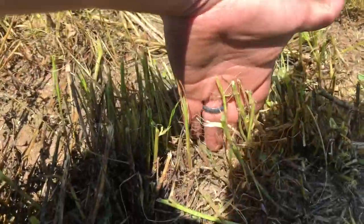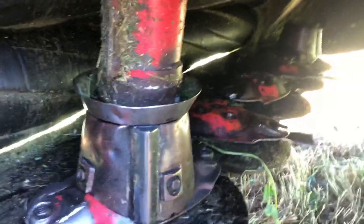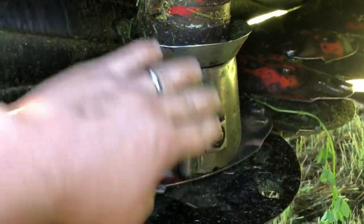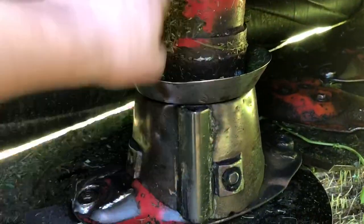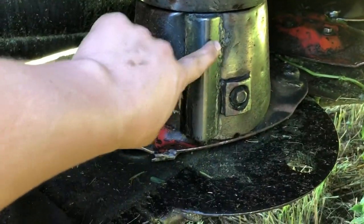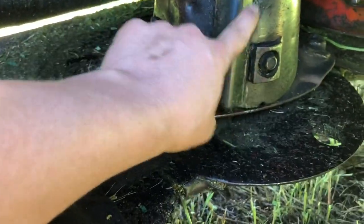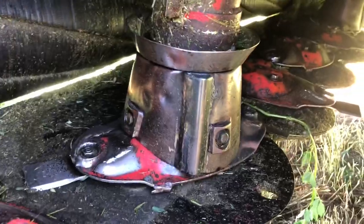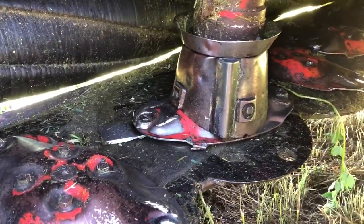I just want to show my stubble height after I lengthened it — it's probably about 4 inches, I would say. I wanted to check under here. We have no wrappage — if that's even a word. Last year I was getting into my really rank stuff when it was down and going into it, so it was actually wrapping up on the drive shaft. It's got a cover, but it was wrapping up on it. And if you see these pieces right here, they were worn out. So this morning before I started, I actually welded a new chunk of angle iron on there. And I think that's what has made the difference, honestly.